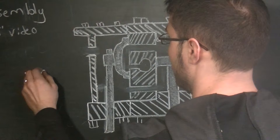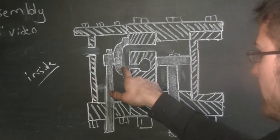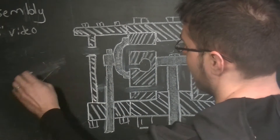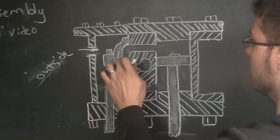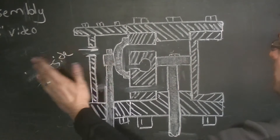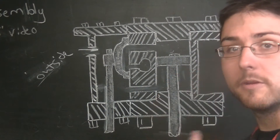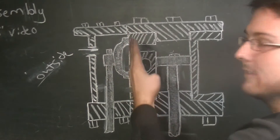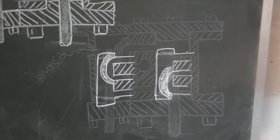This is called inside steam admission, meaning the steam is inside the valve. However, for slide valves, outside admission is typically preferred — steam comes in on the outside and exhaust goes out through the middle. The reason for outside admission is that steam pressure pushes the valve up against the face, creating a better seal. Slide valves are said to 'wear in,' meaning they seal better as they wear, because steam pressure is always pushing the valve against the cylinder face.